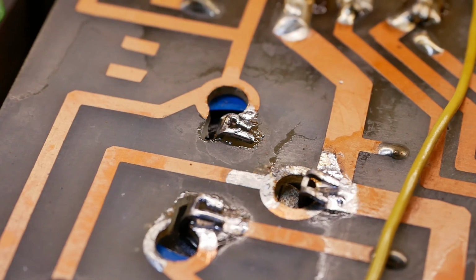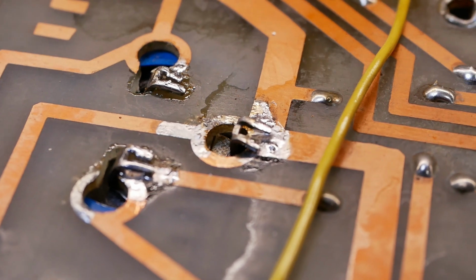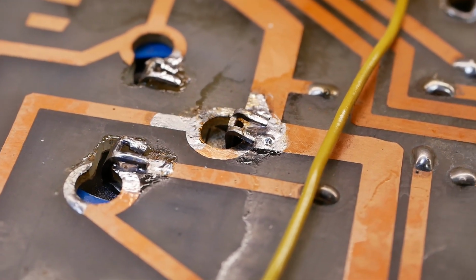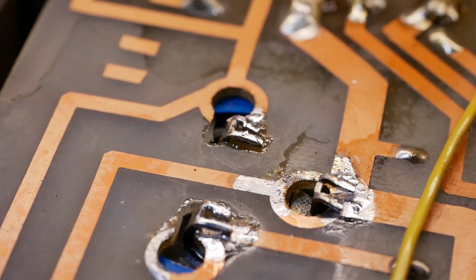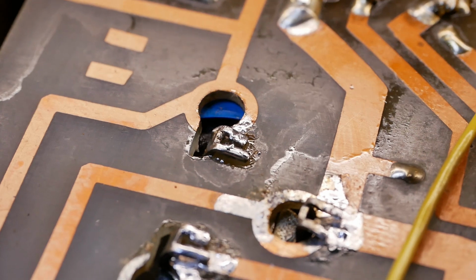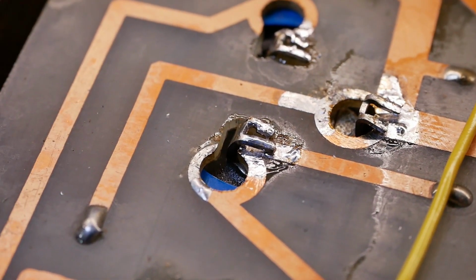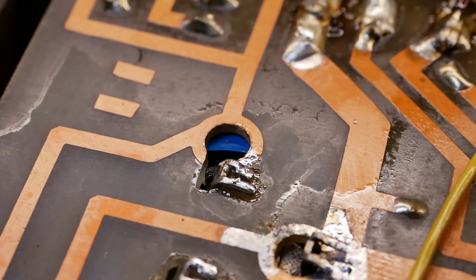So looking at the previously replaced capacitor, you can see the terminals have just been folded on the forks and they're sort of floating in mid-air, relying on the solder to bridge the gap between the terminal and the circuit board. That one's only hanging on by the tiniest bit of pad, so not great. We'll just run wires on there so there's no mechanical requirement of strength there. Everything's supported by the actual chassis bracket.